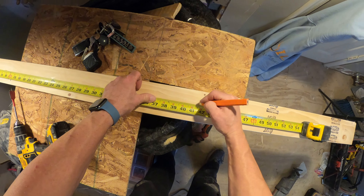Alright, so I built my first frame — I'm going to do two frames. I did a little two-degree bevel so the shower bench will drain into the Tile Ready pan. When I level off the wall, you can see I have a little bit of gap there. Look how nice this frame sits right on top of the Tile Ready system — that's exactly what you want. So I'm going to screw it in right there, and that's one wall done.